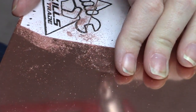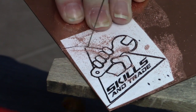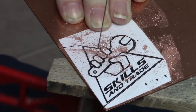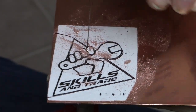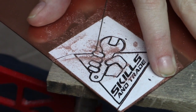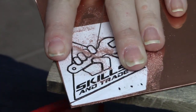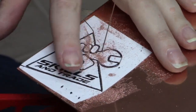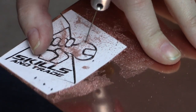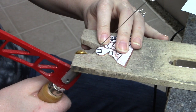If I'm cutting a lot of things I'll clamp a shop vac nozzle to my bench block and use that to continuously suck up the dust. I'm constantly using cut lube to make sure my blade can slide nicely through the metal — you really need it to glide, or the teeth of your blade will catch and you'll break your blades. This footage is at double speed; I filmed part of it at regular speed, but it takes so long that basically the remainder of this video is at double speed.